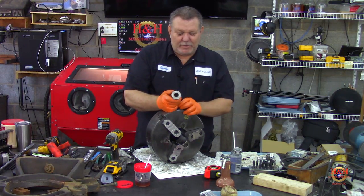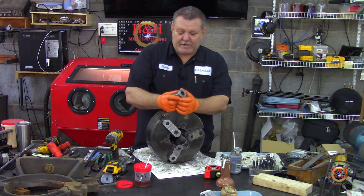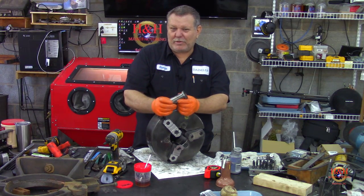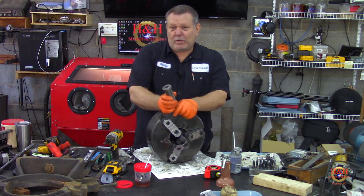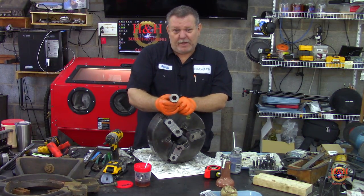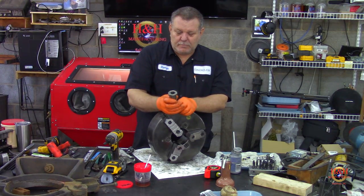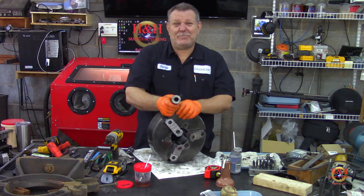I could broach a normal keyway in here and put a couple of set screws in and machine the keyway to screw it to the shaft, but I really don't want to do that — I'd really like to find or have someone make me one of these. I think I will either email Keith Rucker or Adam Booth and see if this is something they might want to tackle. I've never seen this done before and I thought it would be pretty interesting. I'm kind of waiting on that so I can put on all the lead screws. I'll let you know if this makes any progress — until next time, see ya.